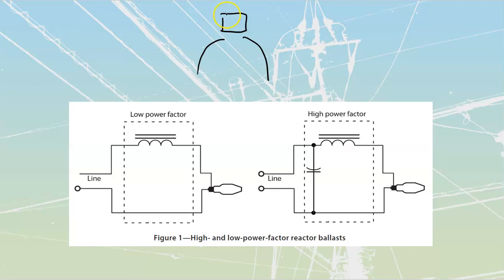And then usually what we will see on a lot of them is there's going to be a set of fins off of there. The fins are going to increase the surface area of the aluminum casing, which means that we can more effectively dissipate that heat out towards our outside area. Where this becomes a problem is in dusty areas, you start to get a buildup of dust, light fluffy dust, which acts the same as a light fluffy down jacket or something like that.